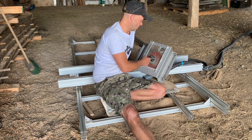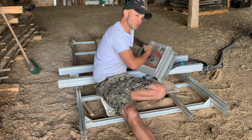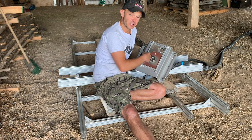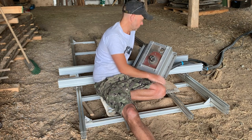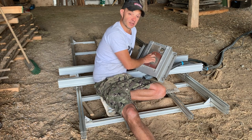And once I've got used to it, I'm going to cut this hole to 60 mil, 5 mil bigger than this bit, so that I can just pop the router in and out really quickly and carry on using it on other stuff. And I'll run that test for a while as well. I'll see, just in case anybody else wants to enlarge the hole for quick release, what difference it makes, if at all.